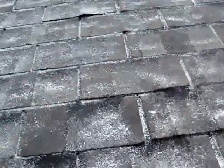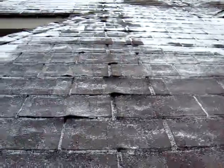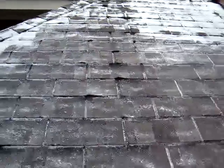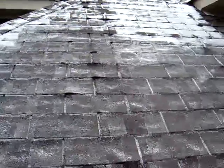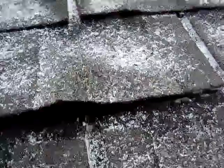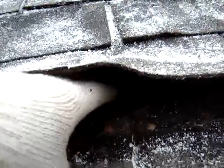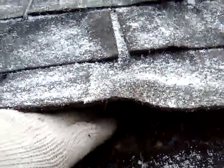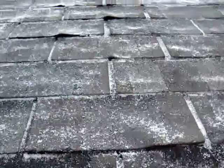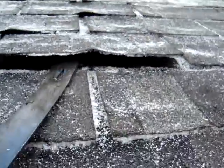Right here you can notice that the two shingles come together — there's a seam right there. If you go above it, it's the same situation all the way up. It's right where the two shingles come together. I believe this is caused by not having the underlayment. You can see there's bare wood right there. What's happening is the heat and moisture escapes only at that spot, comes directly and hits the shingle, and creates this buckling.